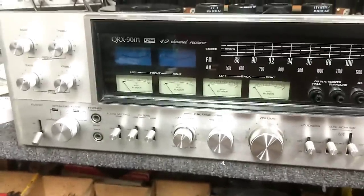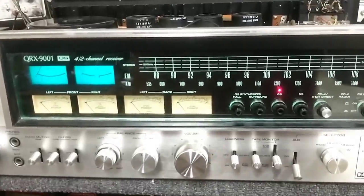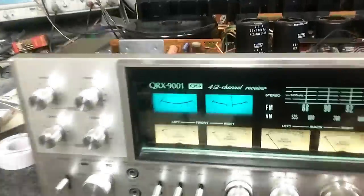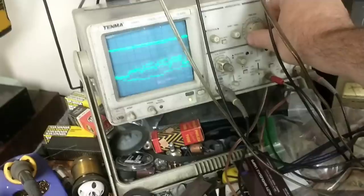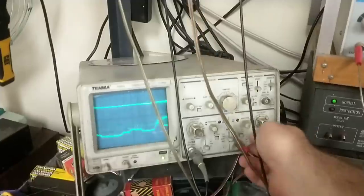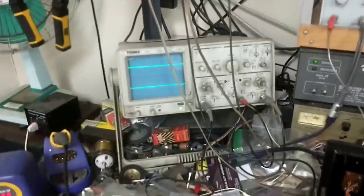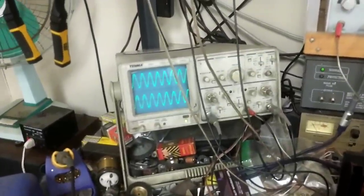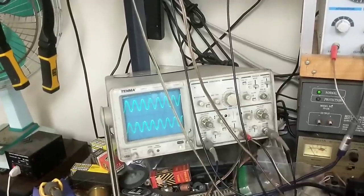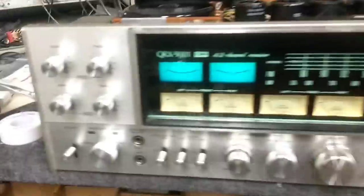Let's see if it behaves itself. We're going to have to put up with our 5G noise — let me go get my RF blanket since we're also on max sensitivity there. You can see now we've got two channels. And if I switch between bridging and non-bridging, we don't get that channel drop that we had last time. Very good — so that's happy. We've got all of our nice pretty meters.